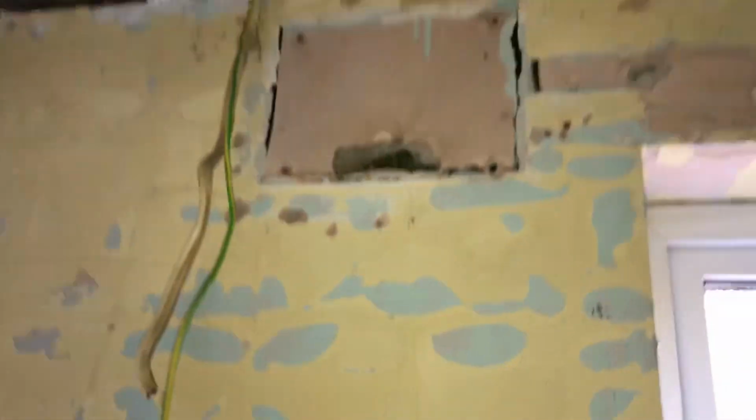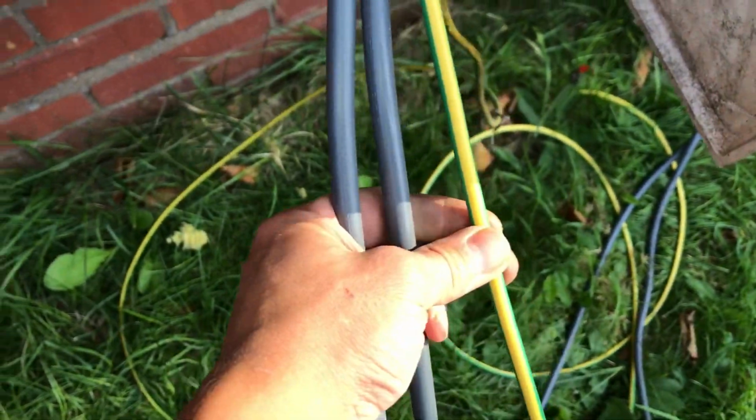So all I've got at the minute is I'll use this old bonding cable as a draw wire, which literally drops down the wall. Comes to here, I'm just going to draw this up now, the new tails, 25mm and a 16mm earth. Wish me luck, eh? You try it one-handed? Yeah, let's give it a go. Real world stuff, innit? Cool.